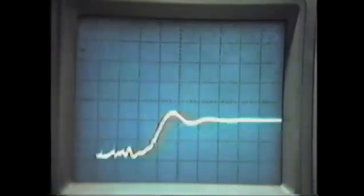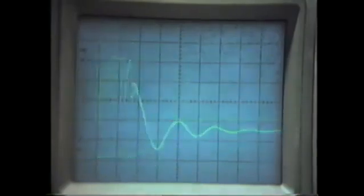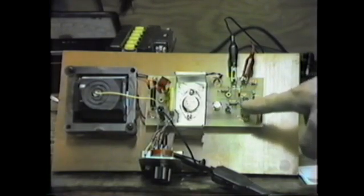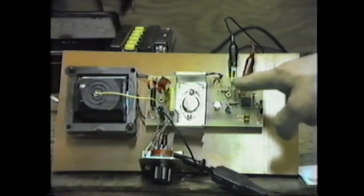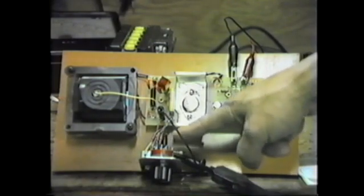So once again, we'll take a look at the machine finished and complete. Okay, this is looking at a finished machine. This is your 555 timer. This is your battery input plus and minus terminals. Your electrode terminals come off this resistance switch here that we made up with fixed resistors because we don't want any resistance to ground. That would ruin the effect of the machine.